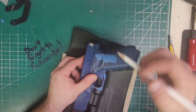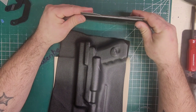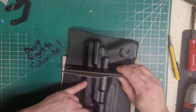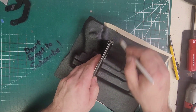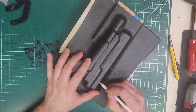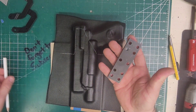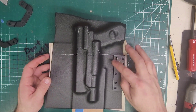We're going to see where our purchase is — purchase is in grabbing the grip — so we're going to be right here. We'll take our contour gauge, which can be found at your local Home Depot or Amazon, and at the bottom we'll go ahead and make sure it's perpendicular to the slide, then draw each one. The purpose of a contour gauge is to draw a straight line across whatever contour you're working on — about $10, definitely needed. This is the drill guide we're going to be using because it fits, and it's multiple so you can swap out different ones.